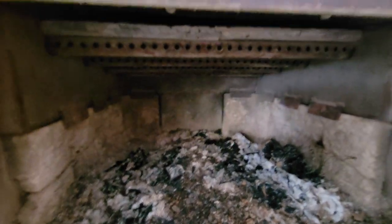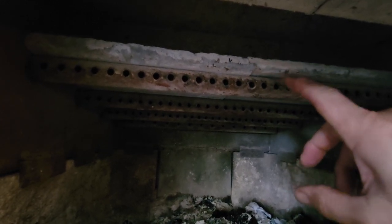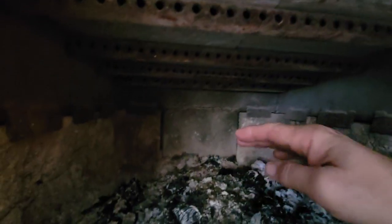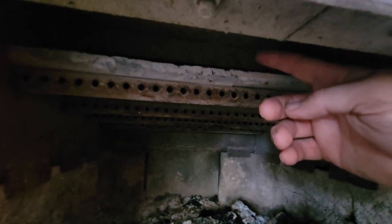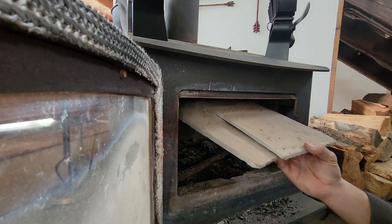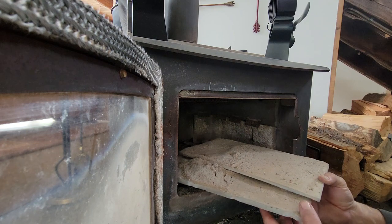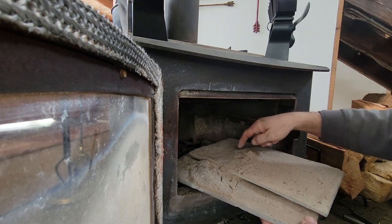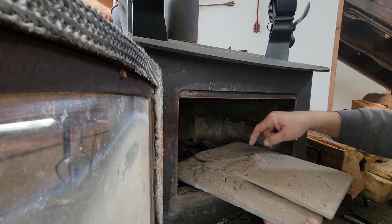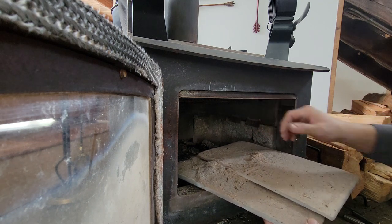There's a pretty good ash in there, but let's look up at the top. I have these air vents or air pipes for airflow, and then I have these ceramic plates — the flames come out here, curl around, and then go back up the stove pipe. I'm wondering if I've got creosote built up on top of these. Look at that — all this ash accumulated on top of these ceramic burn plates. That is significant. This might be what's giving me the black smoke — when this stuff gets hot there's a good chance it's actually smoking.